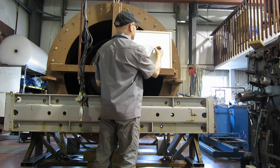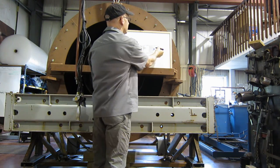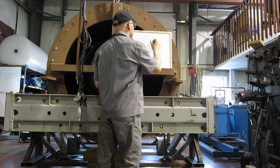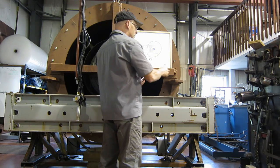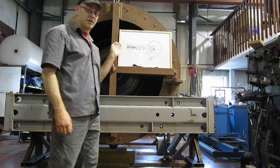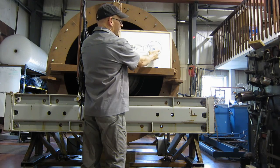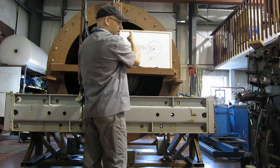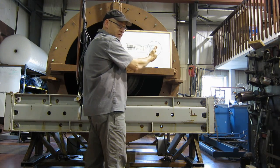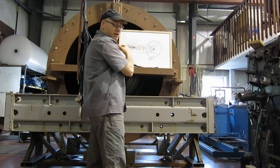This connects to a very short output shaft with that output spline in the middle of it. So this is the power turbine — PT for short — and that drives your mechanical load. Now this same core, the LM2500 core right here, is a separate piece of equipment from the PT, and there are different types of PTs. The one we have here is a six-stage industrial one. We're going to go take a look at the five-stage aerospace, or aircraft, one. We also have a single-stage power turbine that would also fit this engine.